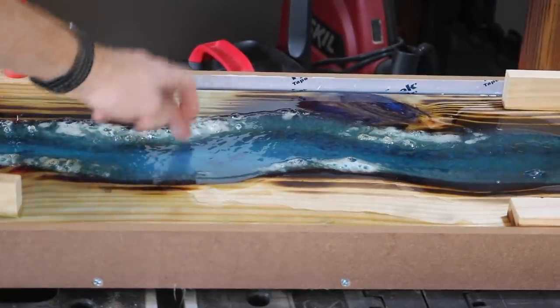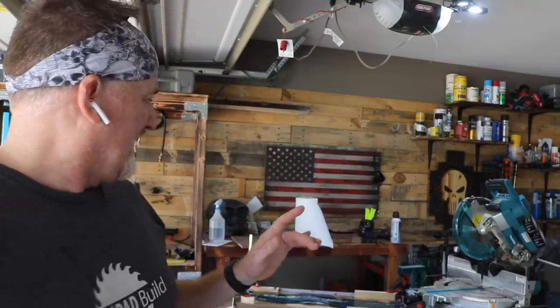Alright guys, so we have a bit of an issue. I poured the epoxy, I thought everything was good, and then this happened. Can you see all those bubbles? Those are all hard. And the thing that sucks is it's 100% my fault. I'm pretty sure it was just too hot in the garage — I thought I had my temperature regulated, but I think it was hotter than I thought. That happens when the epoxy cures too fast. So definitely pay attention to your labels and see the optimal temperatures to pour epoxy in. Unfortunately I noticed it happening at the same time I had to go pick up the kids, so I couldn't really mitigate it. I just had to let it happen.